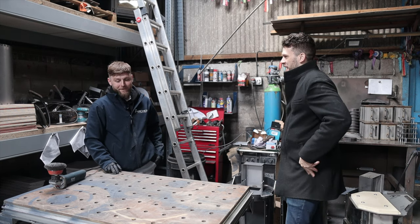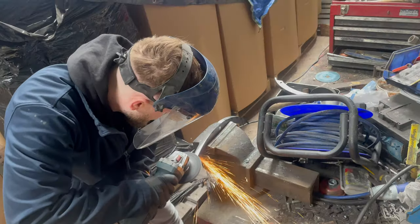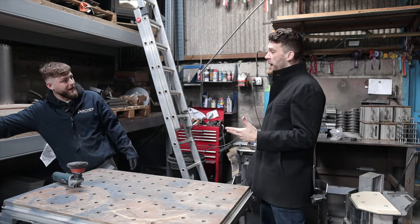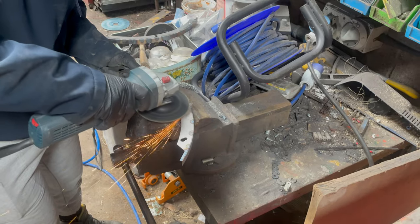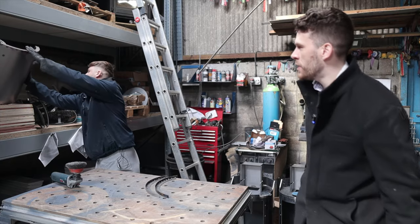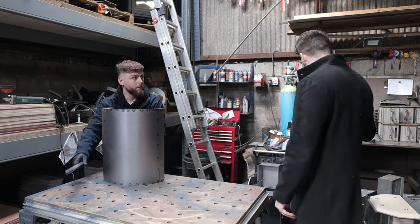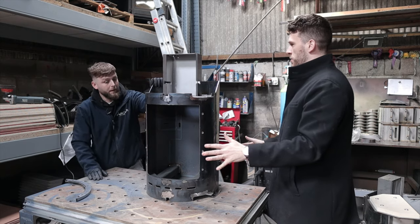Brad, what are we doing here? What's the next step? So in this room I basically do all the sanding. All your panels, going over the bodies with wire brushes — all the prep work ready to be painted. So this is like prep work for painting. And onto doors and everything — it's the same process. How I do a glass clip is exactly the same as how I do a door. This one here hasn't been done yet — but you strip this as well, pretty much yeah.